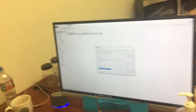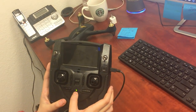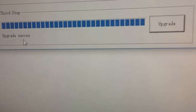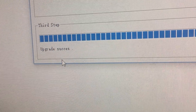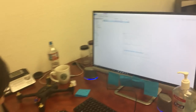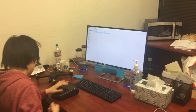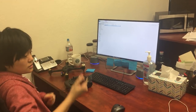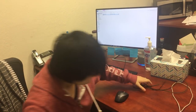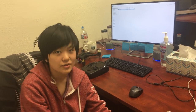Watch the progress bar fill up. The LED will be flashing on and off, then turn green. When it shows green and the tool says 'upgrade success,' congratulations — you have upgraded your transmitter correctly. Disconnect the transmitter. If you've completed to this point, congratulations — you've completed the computer part of the upgrade process.